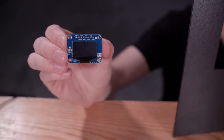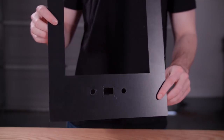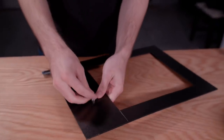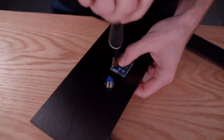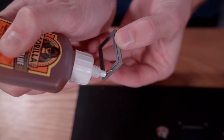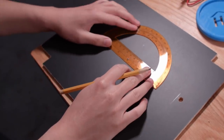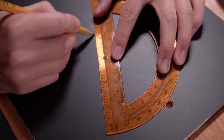We added a mini OLED screen on the front — it's small but high resolution, so it's completely fine for this project. We cut holes for the button and the screen, then attached those to the panel. For the screen we used some 2.5mm screws and attached a front plate to make it look nice. We also printed a cup holder with our fancy new logo. The cup holder has some notches on the back, so we drilled holes in the drink platform to mount it — marking a center point and using a protractor to mark 120-degree angles from the center.